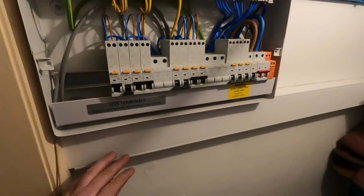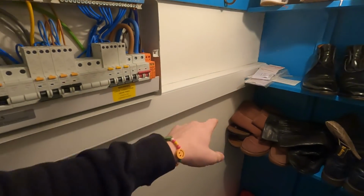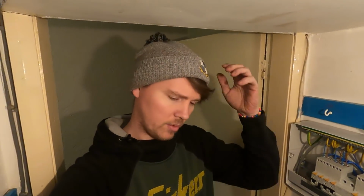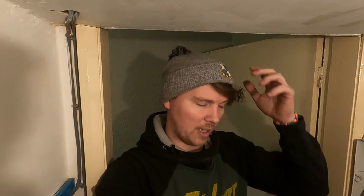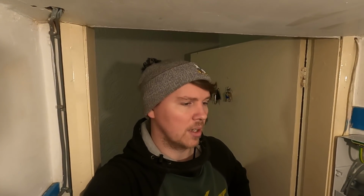So this is the board I put in. Trunk it along, goes out into the garage. I get a few people asking questions about armoured cable, feeding the cables with tails. A lot of the time we just feed it with 25mm tails. We put a KMF switch in, which has the same size cutout fuse as the incomer. If you don't know what the incomer is, normally we put 63 in. Yes, we could probably start using SWA 25mm 3-core to feed it next sort of rewire if it needs it. I'll give it a go, try it out. I just sort of stick with what we know. So yeah, length's over 3 meters.